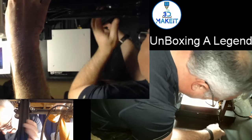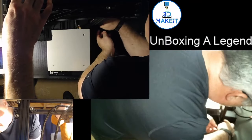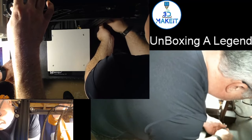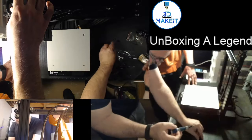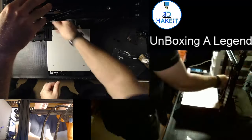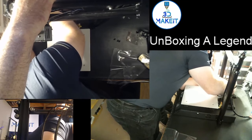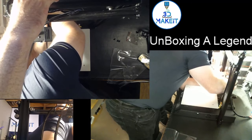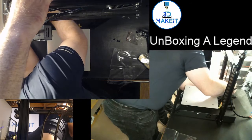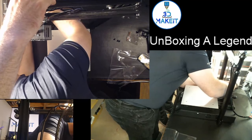So literally eight screws and this guy's together. It's actually amazing. The way they've set up the base of this printer too, I don't know if anybody set up a Tevo machine or the Creality stuff, but without that 4040, it's actually leveled on the bottom. So the chances of having an unlevel gantry or frame that you have to fix out of the box is almost zero. It's a springed coupler on the Z-axis, if anyone's wondering. It's not a solid coupler.